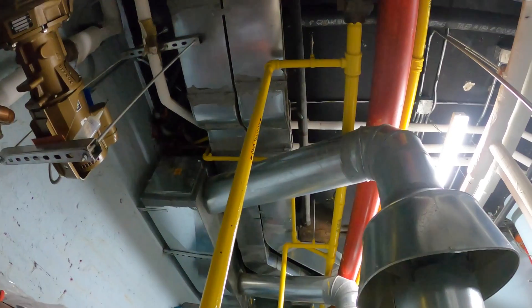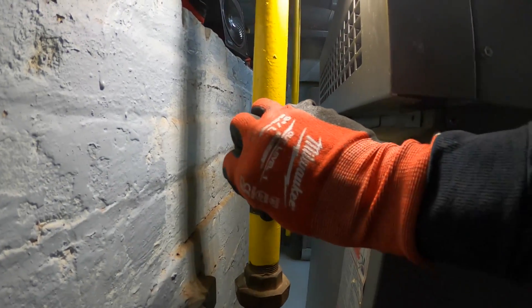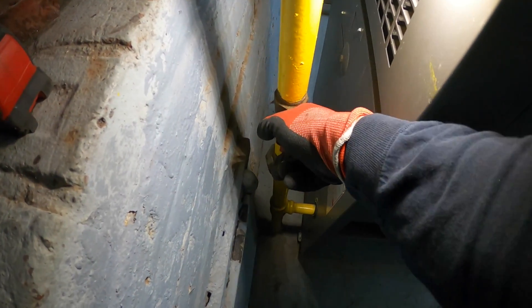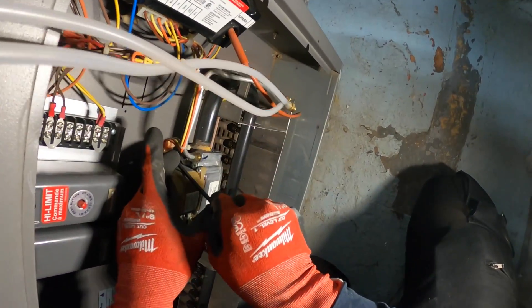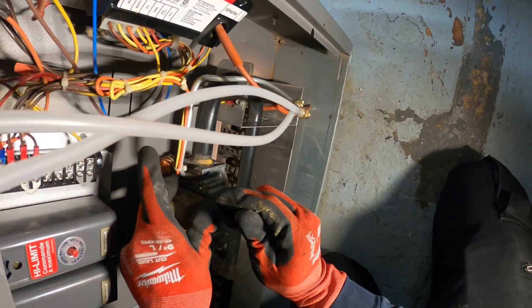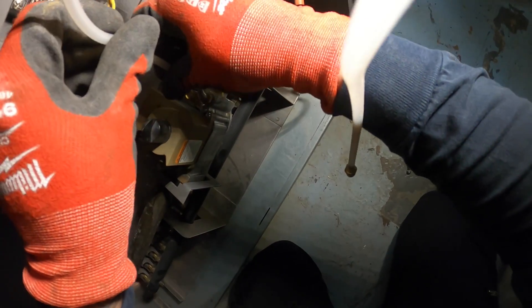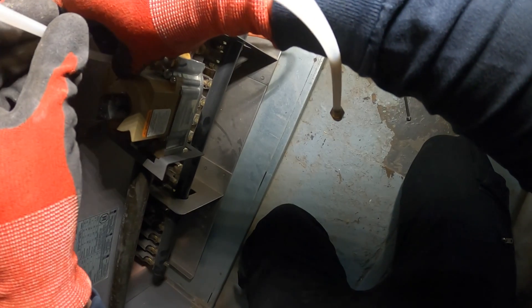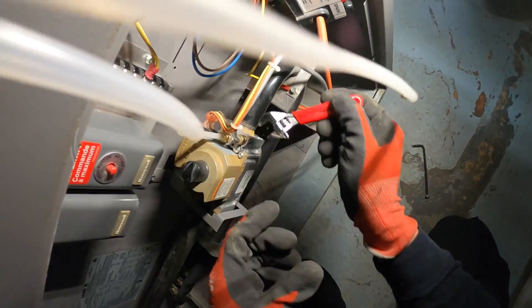Because I need to connect those connections on the gas valve itself, I'm going to turn the gas supply off. We should be fully closed there. Here's going to be our outlet — I'm just going to use that as P2. You need to get an Allen key and loosen that up. It's kind of a tight spot for the outlet, but I'm going to connect P2 in that place. I'm simply going to spin that on there and make sure those threads are good.